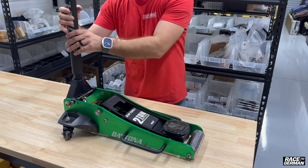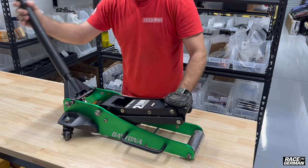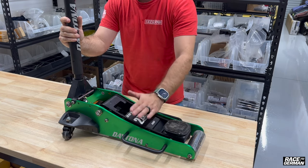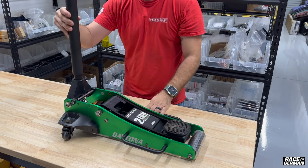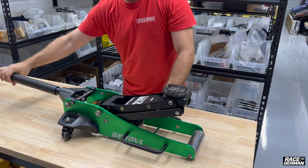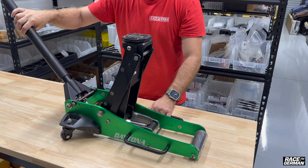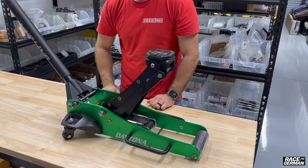To try this out, we need to turn the handle clockwise this time to close it, and we'll just start pumping. Immediately, I can feel that it's firmer and it's pumping faster. Harbor Freight says from the factory that this Daytona two-ton jack should be able to go from its bottom level to totally top in five pumps. So we're going to test that — one, two, three, four, five. That's it, five pumps. So it looks like the system's bled, everything's good to go, and you should have a good working jack for some time to come. Thanks for watching.